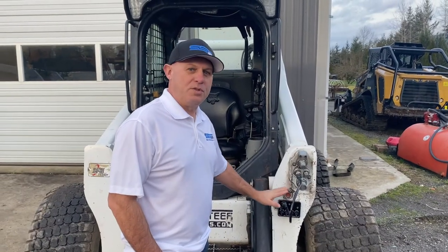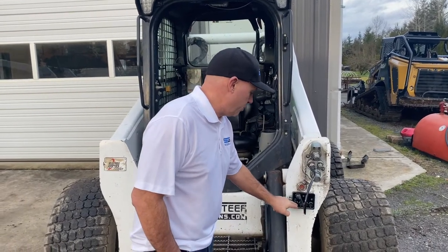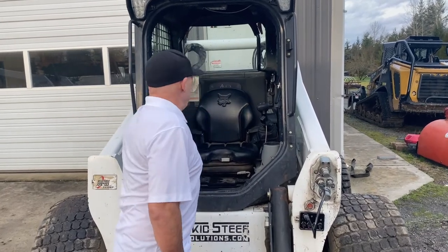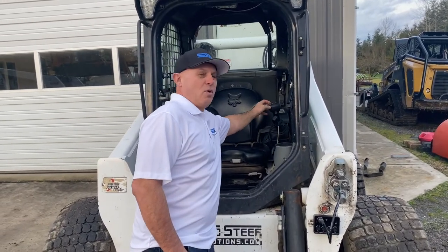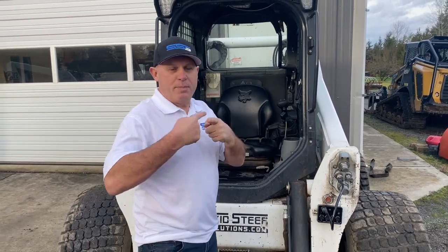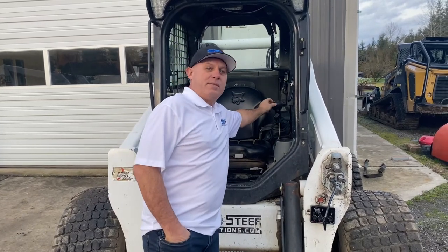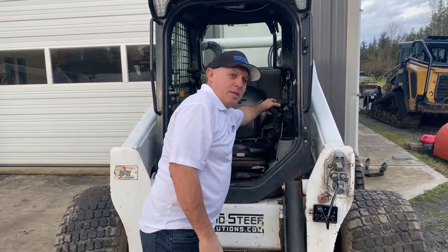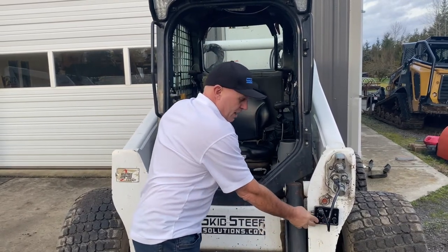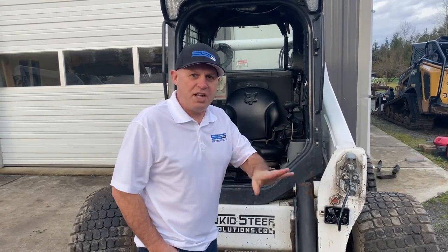So when we ship this to you, it comes already set up with plus 12, plus 12, plus 12, plus 12. So you're going to use what we call B1, B2, C1, C2, which are the toggles that go up and down on your left and right handle, and they've got a picture of two opposing cylinders. Those are the buttons you're going to use. My B1 gives me A channel, my B2 gives me B channel, my C1 gives me the C channel, and C2 gives me the D channel. And that's how it comes to you stock. You don't have to change anything.